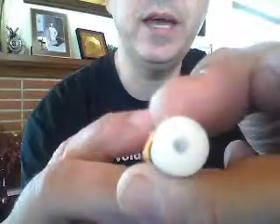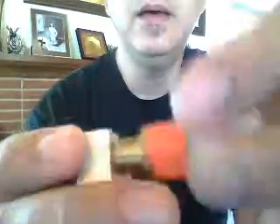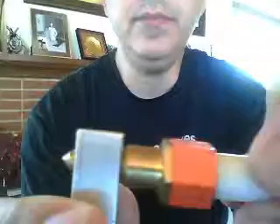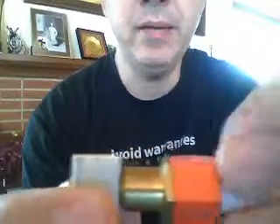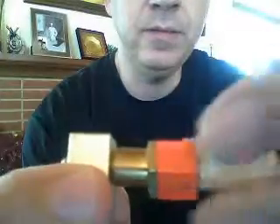The trick is to get it to be a sort of watertight barrier before the melt pot. You want it to be tight, but not so tight that it totally binds everything and causes the filament to bend up in the cold end of the nozzle.